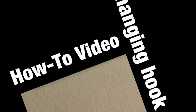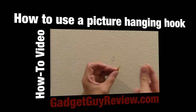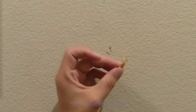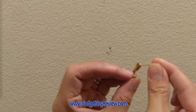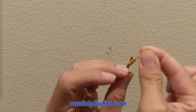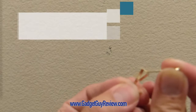In this video I'm going to show you exactly how to hang this picture hanging hook into the wall using this 10-pound picture hanging hook. I've reviewed the entire set and it does come with a 1-inch nail. It's going to go basically at a 45-degree angle, which is going to keep it much better than going straight into the wall. These hooks must go in at a 45-degree angle, so let me show you how this works close up.